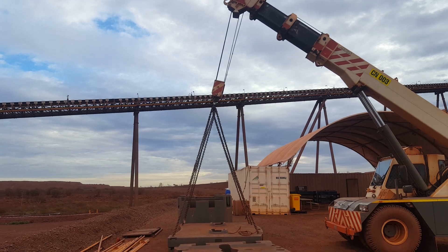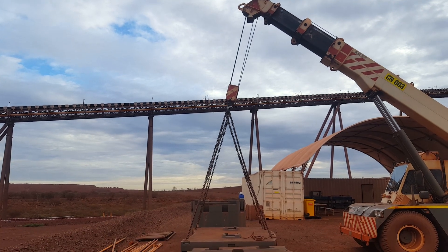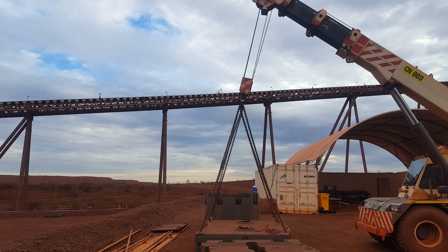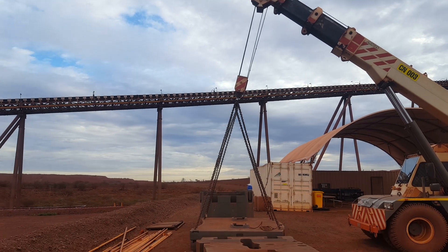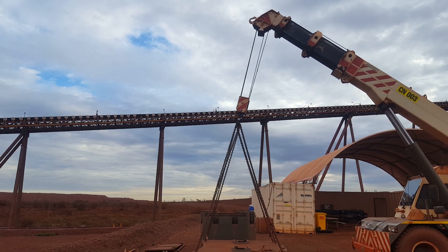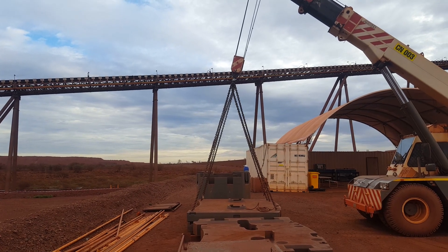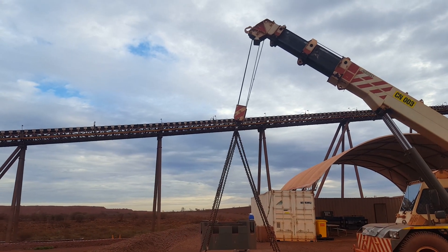This is a classic example of under-jibbed. We're under-jibbed because it's on the angle the other way. That means this is dangerous, because when you pick up this load it's going to swing back into the crane. This works on slew cranes, not just franners — any crane. If the angle of your wires is off like that, it's danger zone. Especially in big cranes, the crane driver can't see his angle because he might be 30 meters away. You still want to get it straight up and down.